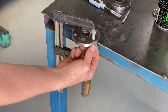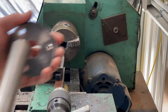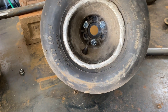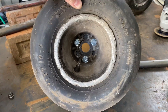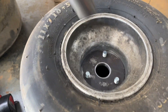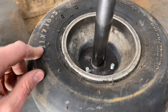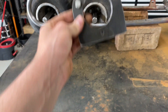We can double-nut it — top one up on the back — and that shouldn't come loose. We got that to fit good, nice and tight. Got the hub mounted up. This rim is actually probably the roughest out of them all — I think it's been drilled out a few times. Anyway, that all lined up pretty well. Slide the axle down like so, nice and tight. Get it into position, tack it, and then we can pull this whole thing out and fully weld it. These plates made up — let's get the bearings mounted.